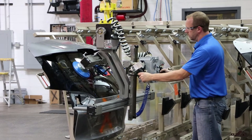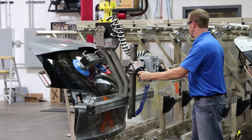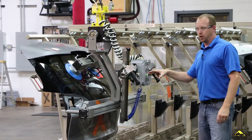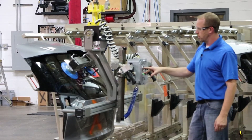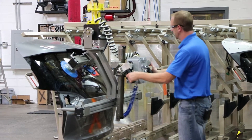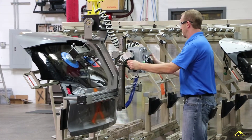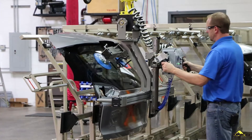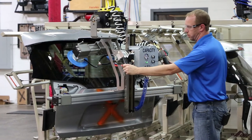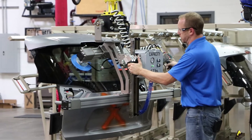Vacuum on. Once the cups are in position and safe to lift, the vacuum indicator will come on. If we don't have more than 18 inches of mercury, the up button is disabled and will not work. The vacuum off will also not work unless the common trigger is pulled at the same time for a two-hand safety release.